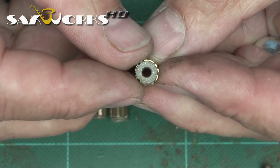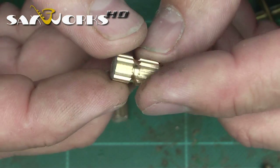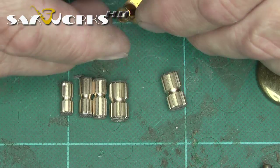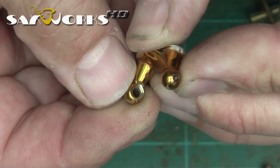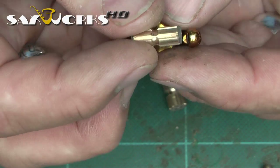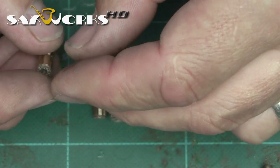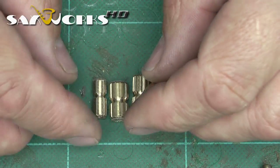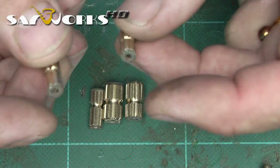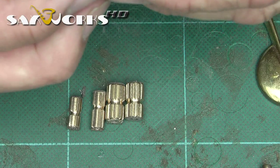I set up diamond cutting tube and post planers. These are very simple tools, but they are very effective when it comes to planing post faces, like this one here. It's really just a matter of finding the right size. I made a set with 2.0, 2.2, 2.5, 2.8, and 3 millimeter holes, so I'm covered in terms of every single rod diameter.